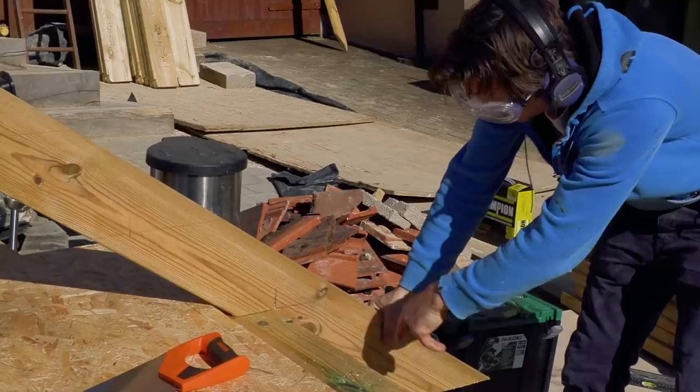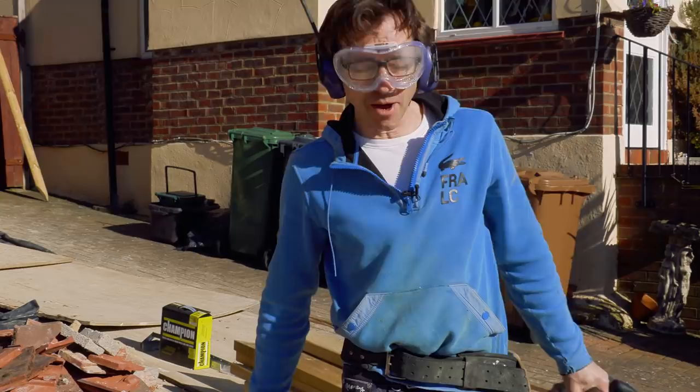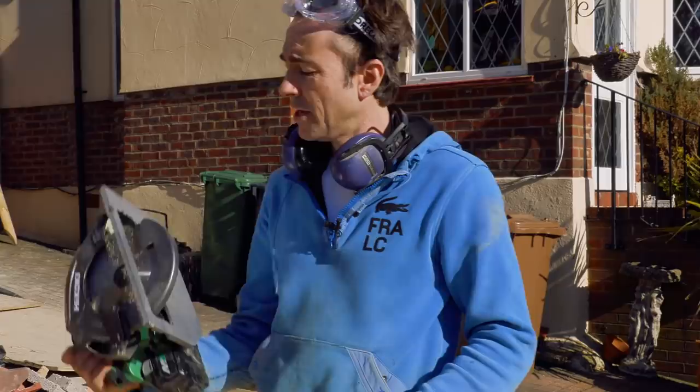That is effectively our rafter and this is indicating the wall plate. I've got 30 odd to do, so I'm going to do something I've not done before - it's a bit of an exclusive. It's something I do a lot when using a router: I make a template and use it with a guide bearing. Now with the advent of small powerful portable saws and tools, I can do things I could never do before.